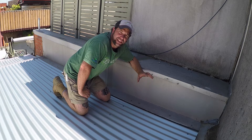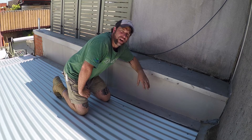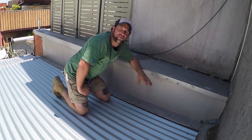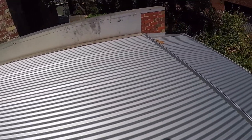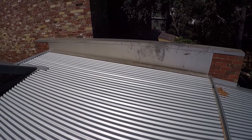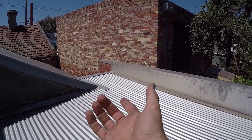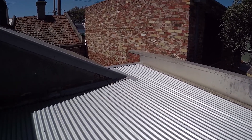There are certain roofs that can have a one or two degree pitch, but they're a special type of roofing with no roof penetrations such as screws or fixings that are visible. You can see here how flat this roof is — there's not much of a pitch on it at all, which means in high wind the rain will run up the roof, go underneath the flashings, and then come back down underneath the roof sheet or worse still down all of the walls.